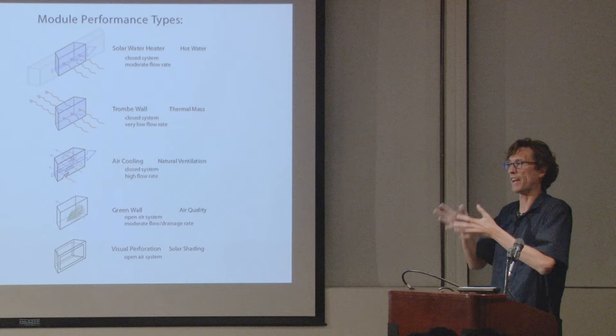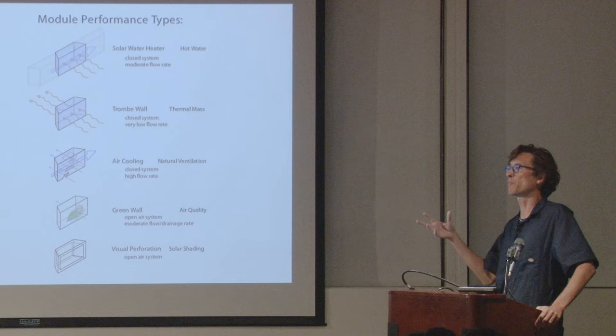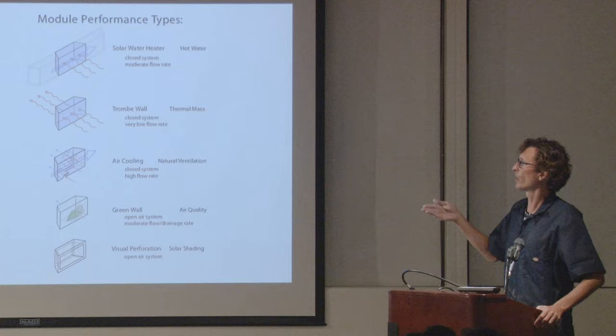All that to say is that clay can actually absorb and then dissipate water on the other side, if you get a porous type of clay. Which means that as that water evaporates out of the clay, if wind moves past it, it's going to cool that wind. So you could actually use these modules for evaporative cooling, and you could start to cool the spaces around the modules. And then another possibility was using each one of these modules as planters, because it could simply be a pot, and you could place thousands of pots on a building facade.